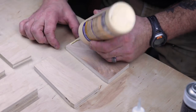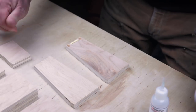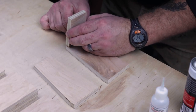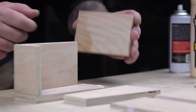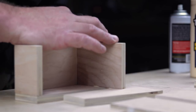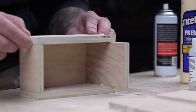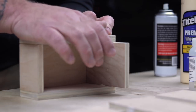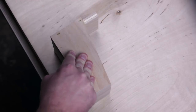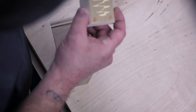To keep all these in place I'll use a combination of wood glue and CA glue with an accelerant, and that'll hold everything in place until I use staples or brad nails to assemble them all together. The two inch piece goes in front, the five inch piece goes on the bottom, the four inch piece goes on the back, and the two six inch pieces go on the sides. Once you get it all cut up it's pretty self-explanatory. I like to use staples for projects like these, but you could use brad nails or just keep the super glue and wood glue — that'll hold up over time as well.